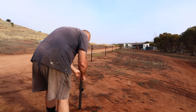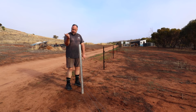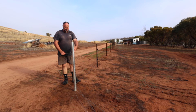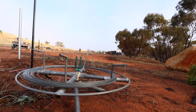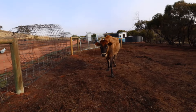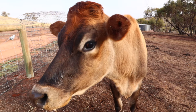Let's talk about jennies. This is a spinning jenny — you basically just chuck your 1500-meter roll of wire on. You use these adjusters to centralise the wire on the spinning bit and just tighten them up. As I walk off with the wire, it'll just unroll nicely and not get tangled up — it doesn't take any effort. I'll just feed it through the picket and make sure I'm in the right hole.